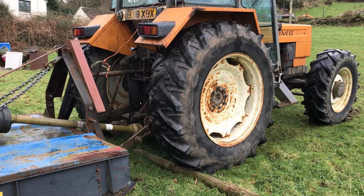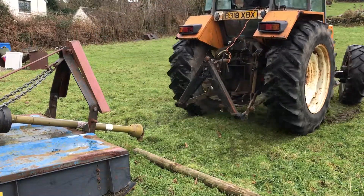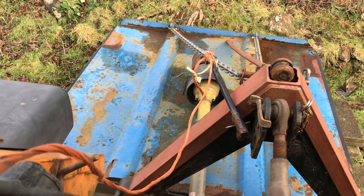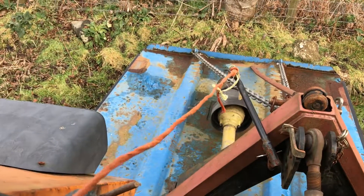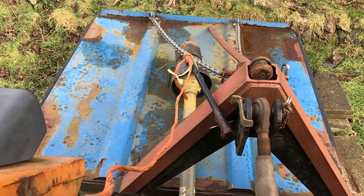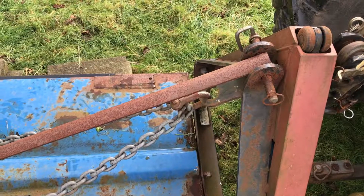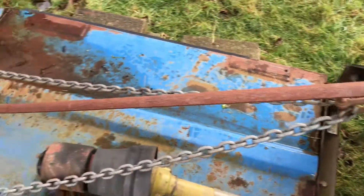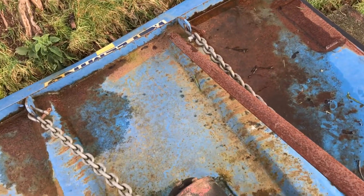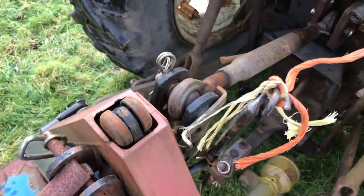You've got to adjust the top link out so it's straight in line with the receiving frame as well. That's the view from the cab - you can see the roller ball on the top needs to be covered in grease, but that slides up the frame. There's a hook at the back that catches it and locks it in place. That's a support bar for the topper bracket - it's just to stop it falling down when it's not connected up. You take that off when the topper's in use.